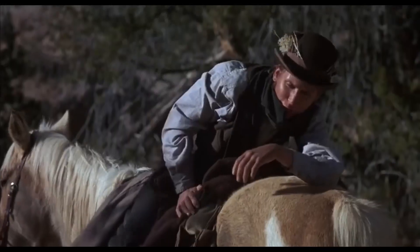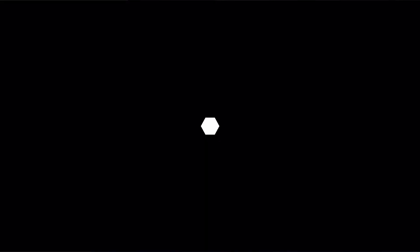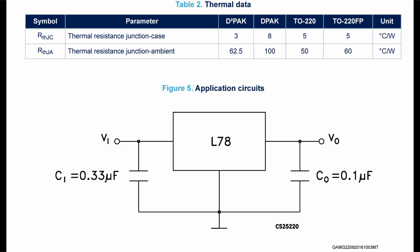It's time to attempt to blow up some circuits. We've got our first experiment here. We're going to take our L7805 5-volt regulators that can handle up to 1.5 amps. We're going to take our suspect USB fan — this little $3 fan — and see what happens. The configuration is: set the voltage to 10 volts going in, with an output of 5 volts, using two capacitors as specified on the datasheet.